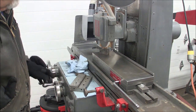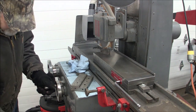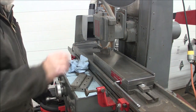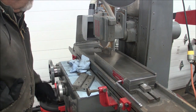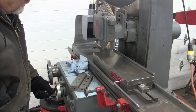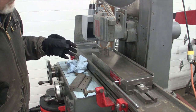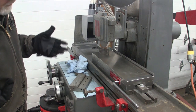Okay, and the magnet's on. And just for the fun of it, I wonder how close I come down to it. One thousandth. I was within a thousandth by just watching the light between the diamond and the wheel. So, here's what I call a quick pass. Okay, another half thousandth, and back. So feed down, one pass across at about a thousandth, and bring it back without changing anything,